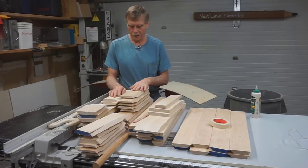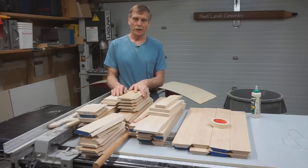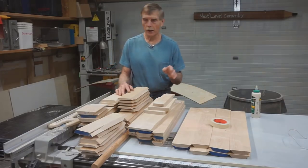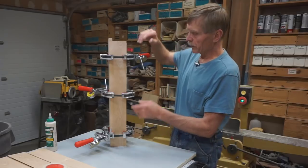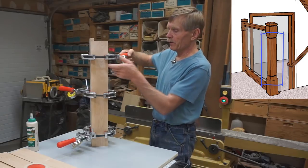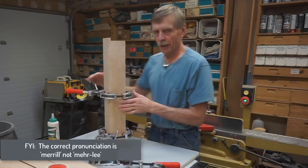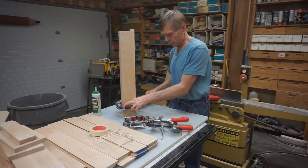This is always one of the more exciting stages of a project — going through the process of making the coves, cutting the bevels, getting everything mitered and planed up ready to glue — that's when stuff really starts to take shape. I'll be doing more work on these pieces later, probably in a different video, but for now I'm gluing up the waste sections for the centers of these newel posts like you can see in the SketchUp model. I already went through the process with one of them using these Merle clamps, on loan from my good friend Jared at Legacy Construction — they work fantastic for gluing up stuff like this.